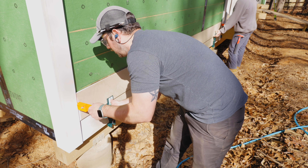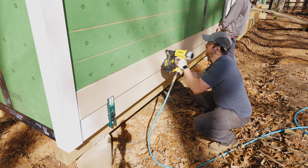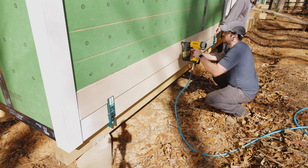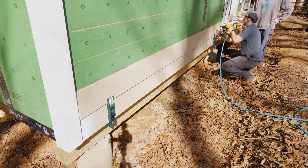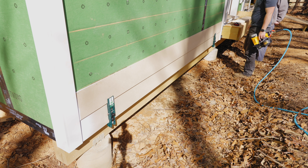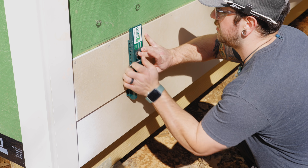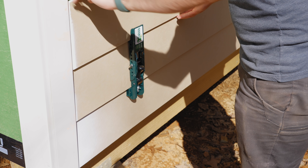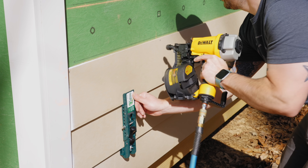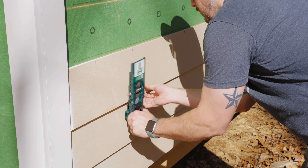You can set your reveal in quarter-inch increments, so we set the seven-inch reveal we were after. After clamping down a gauge at both ends of that first row, we could set the next row in place and get it nailed. We had marked chalk lines on this first wall to make sure our gauges were working properly, but really they're pretty foolproof as long as they're butted up securely against the bottom edge of the previous row. From there it was really just rinse and repeat on this wall.